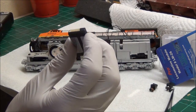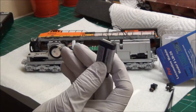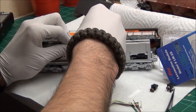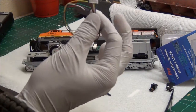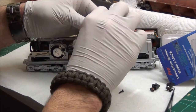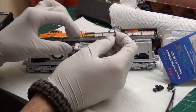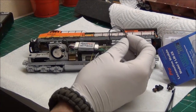This other side has another plug they include with it. Two of the wires coming out of this side are going to be for the speaker. You've got two more outputs on that side and also two inputs — they're still working on what they'll use those for. To hook it up, take the module, line it up with the JST plug, make sure it's oriented correctly, and that's it. To hook up the speaker, take this 6-pin plug they provide, plug it in, and these two brown wires are the speaker wires. When using a single speaker, if nothing is marked positive or negative, it doesn't matter — solder either one onto the two leads for the speaker and you're good to go.